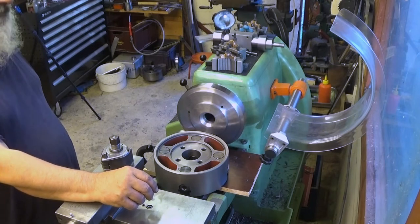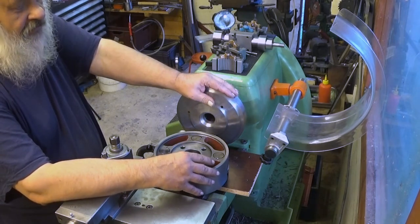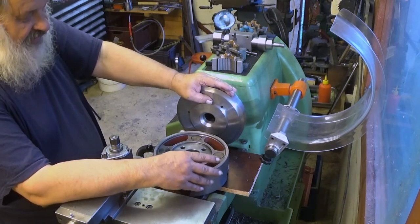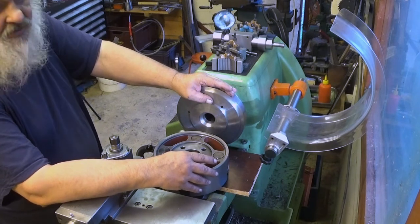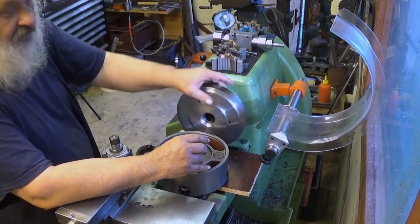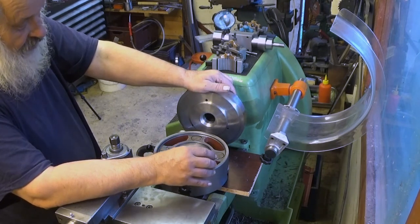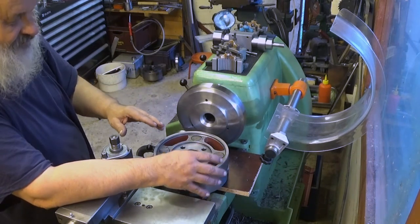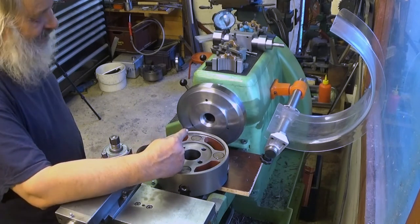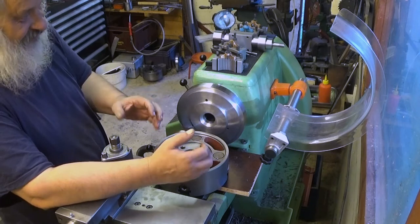So, well, okay. In this case, because it's a radial play we are going to have here, and it's quite minimal, what it will impact is the balance of this thing. And that much wiggle I actually can hammer out. When I put the chuck in there and you can tighten it from the front side, I can dial it in and put it in the exact center. Well, okay. But now what we need to do here is I will accept this. It doesn't make me happy, but I will accept it. I don't want to do this again. And I can really hammer it in. And furthermore, I don't need to make the jack screws for these ones to get it out from there.